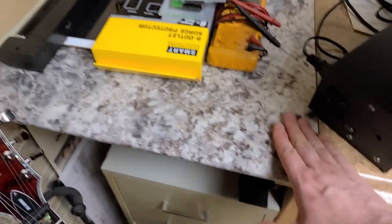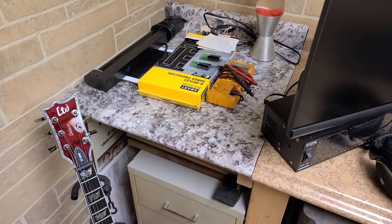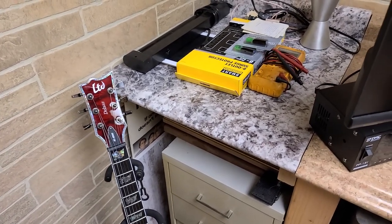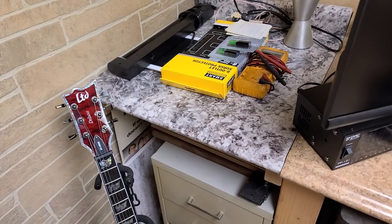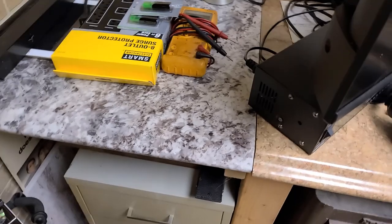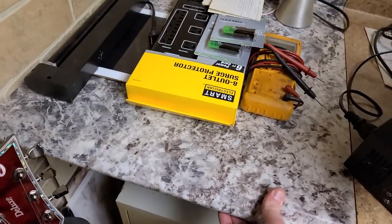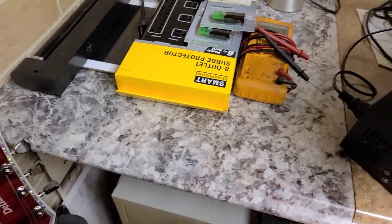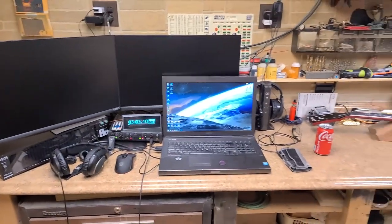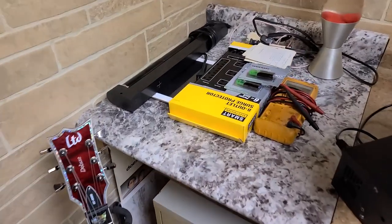The front of it matches pretty good — it's even here and even here, but not so even right here. Everything is flush, leveled, and mounted — it ain't going nowhere. This room was made with steel studs all the way around and I've got two-by-fours underneath this thing mounted into the steel studs. The counter is screwed to the top of the two-by-fours, and I've got a piece of two-by-four locking it in place — this is not going anywhere. That's what I've been up to, trying to clean up this mess.